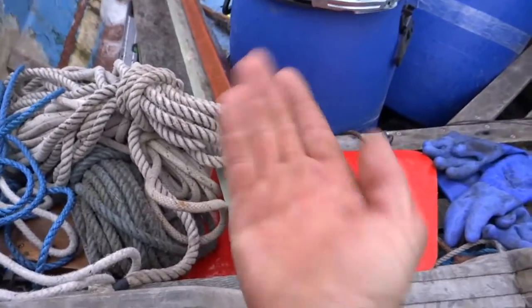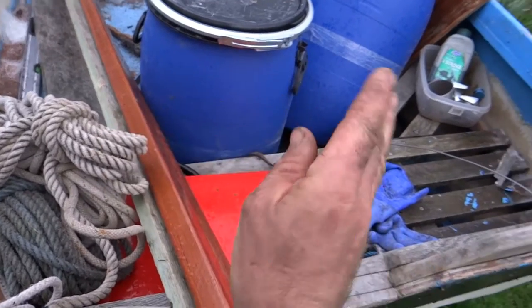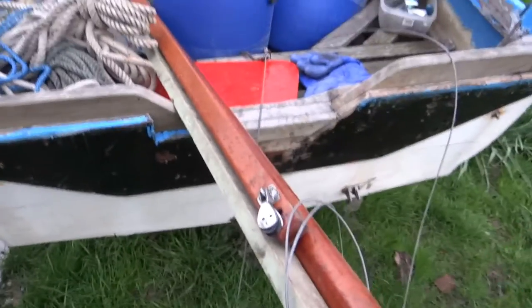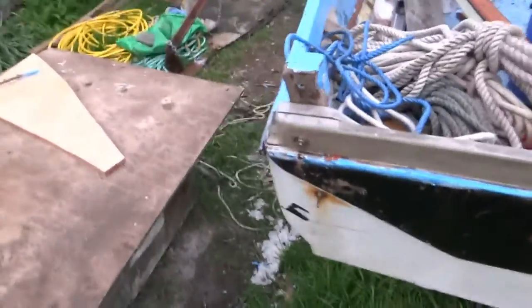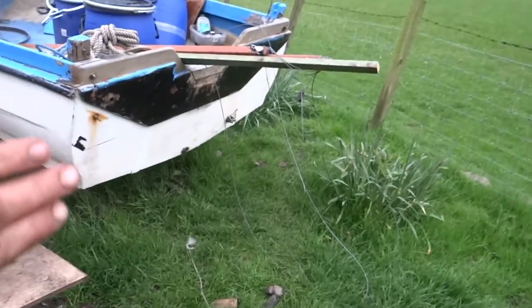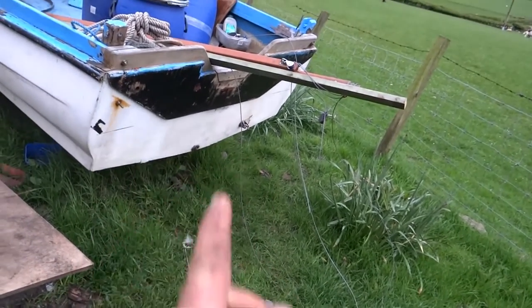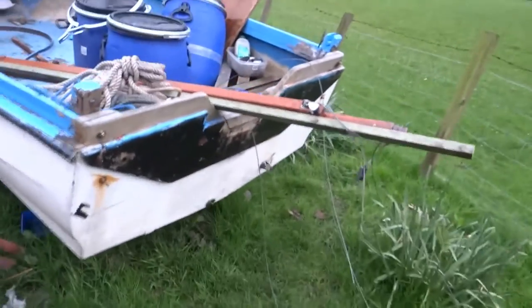At the top of the bar it'll be like a flat section, and on the flat section there'll be the tiller arm that'll move either way, which should be good. I might need to buy some nice stainless links or something, but just make it strong for now. I'm going to use the bar, stick that through the hole, and then maybe make a kind of union plate that'll bolt through the GRP at the back, for the tiller rod.